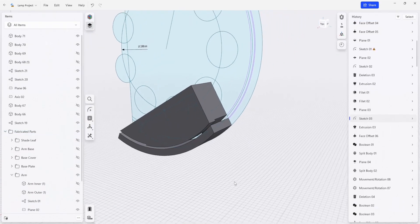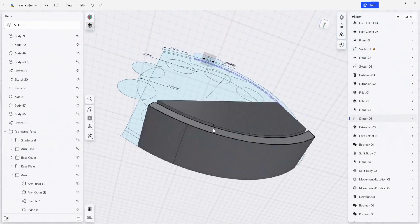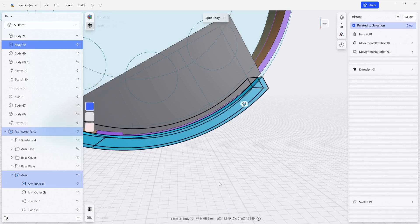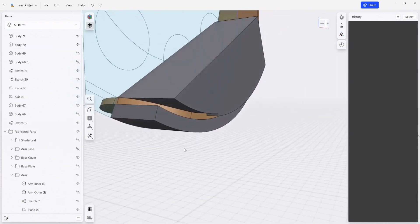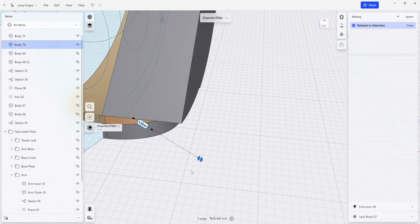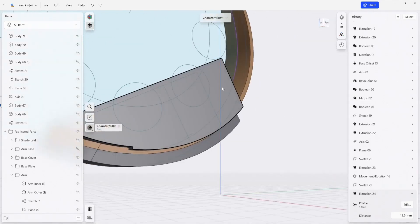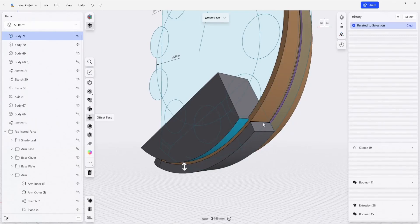If we hide the inner arm, we'll see that we have a cutout that matches up. Now all that's left is to make sure that we have the top feature to be able to route out that part. I'm going to bring back that arm, select this and the surface, and do a split body. I can delete this section because we don't need it. All that remains is to fillet this corner here to match up with the lamp. Now the router is going to be able to run along this top surface and cut this inner edge perfectly matching. This tool will locate itself along the lamp using this feature that already matches up with the piece cut from a previous die.